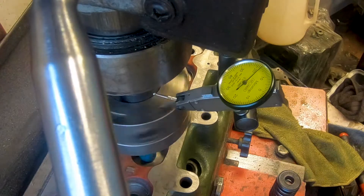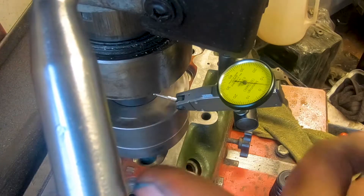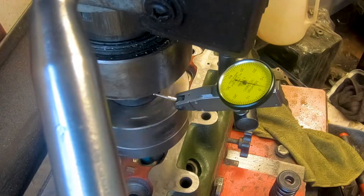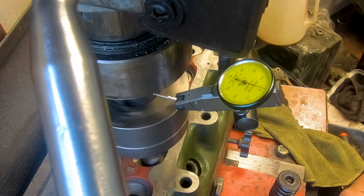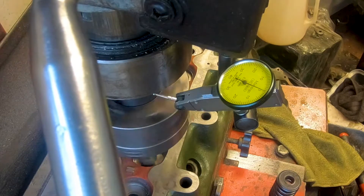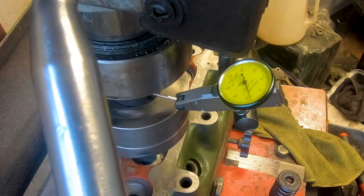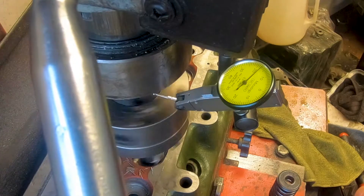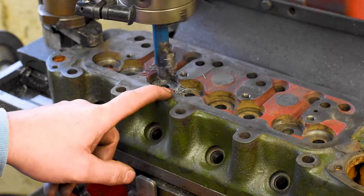So the cutter is now turning. I'm going to bring the cutter down and you'll hear it just starting to graze the top of the material. You'll see the cutter bobbing — that's perfectly normal. This is a very accurate indicator, so it's just picking up the cutting action of the cutter. The cutter has now come into contact with the cylinder head and we're going to start actually cutting. By adding a little bit of cutting pressure, the cutter is starting to cut. There's 0.1... there's 0.2... 0.23. And we can see the material that the valve spring seat cutter has removed.